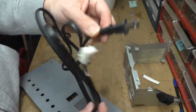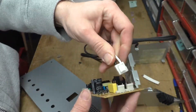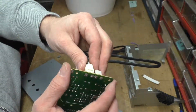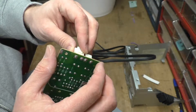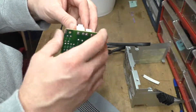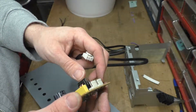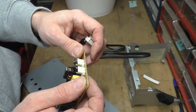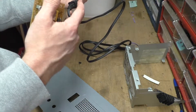While I'm out here I need to get that kind of cord — I'm not going to use the plug end of it, just the actual cord. Curiously enough, I have these old power supplies ripped out of something, and this is actually the part that brought power into it, but the terminal next to it is what went to a switch. My thing is I need to connect the power cord from the back of the power supply to the switch in the front, and then from that back to the actual power supply. With the third wire — the neutral — it was making it a little harder, but now that I dug this out I said maybe I can just cut this board right here and use this in-and-out piece, mount that inside the project.